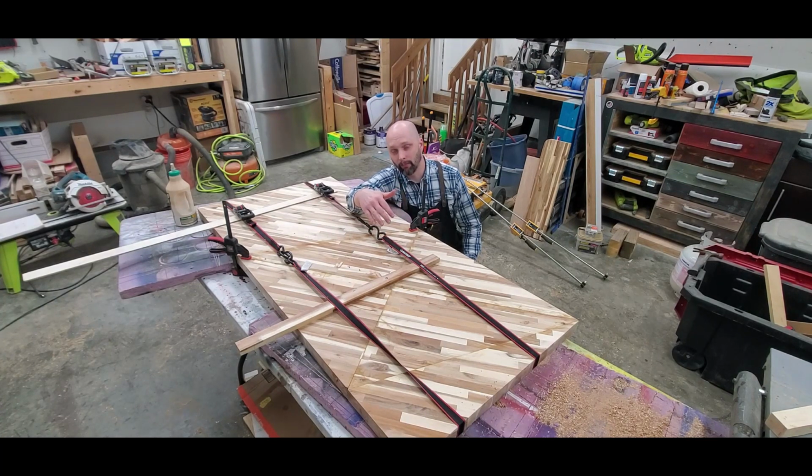After I cut it down into board size pieces, I'm going to send it through a planer, and that should take care of any inconsistencies with levelness. The bigger problem was that I thought I was going to save some time by going ahead and plugging up these holes with the pocket hole plugs, and I totally forgot that I left the screws in there, and I can't do that. I was supposed to take the screws out tomorrow and then plug them up and just take the time that it takes, but I didn't.